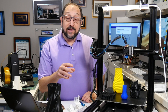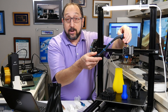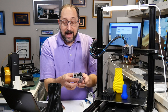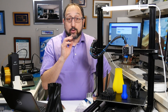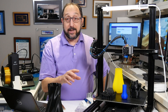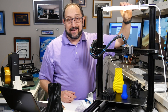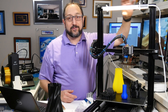Let's look at some of the upgrades I've made. You'll notice this blue Bowden tube — this is a Capricorn Bowden tube that I mounted on the outside. I did add an all-metal extruder, and I have an OctoPrint OctoPi attached to it. I plugged it in, it recognized it immediately, and I didn't have to add any plugins for the printer protocol. I also have an $8 LED light from a big box craft store mounted on top with just a couple of cable ties.